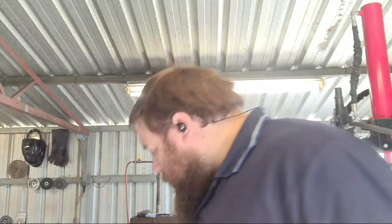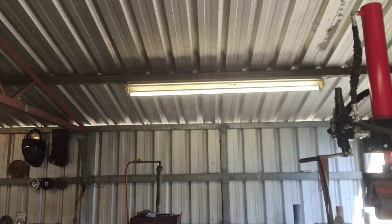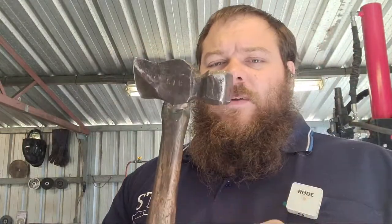But when it comes to planishing and finishing blows or doing tight areas and stuff like that, I prefer the slightly flatter face of yours, especially because it's got the sharper angles on the face. So both have their place. And plus, this is a diagonal Pein, his is a straight Pein. So occasionally I need a diagonal Pein, occasionally I need a straight Pein.